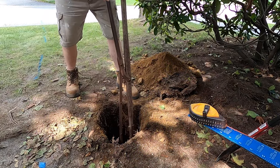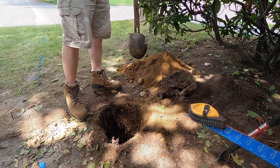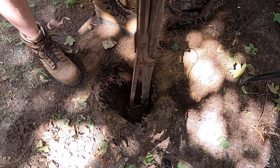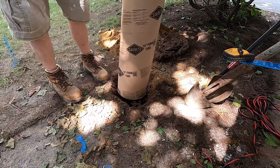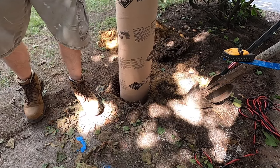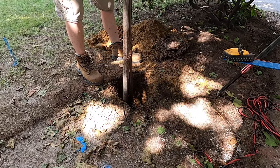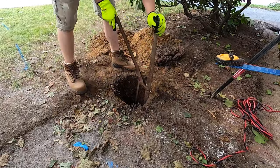I'm not going to go into too much detail about digging because it is pretty simple. Of course if you live on a mountain or if you're trying to do this in the winter with frost, you're going to have a hard time and might need something more than hand tools. But this is your typical situation — somewhat rocky soil. The best thing to do is use that bar in combination with the post hole digger. I've even used that bar to smash up slate and used a shop vac to pull the dirt out of the hole, and it works.